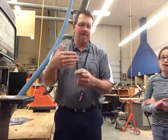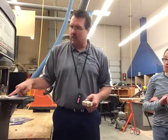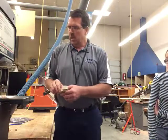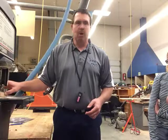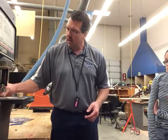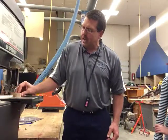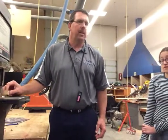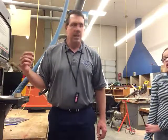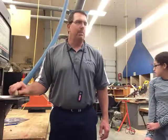That piece actually fell out so I can back it out — because I'm not backing out of a thin cut, I can pull it out before it stops. If there's a piece stuck there, what do I do? Keep cutting. Most of the time I can keep cutting. If it does get stuck down in between and it doesn't come out and I can't cut — like if it's blocking me from cutting — then I have to stop it, wait till it stops, shut it off, and then clear the piece.